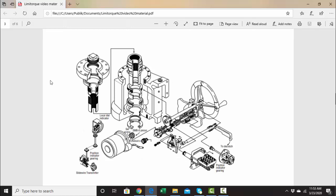This is the exploded view of the actuator we were just looking at, this being the motor seen on the side. Underneath the cover is where we have the limit switches and the torque switch. The limit switch is controlled by how much this worm gear moves, which in turn turns this gear here, which is going to bring the shaft up and down. The position of the valve relative to the gears is going to control the position of the limit switches.